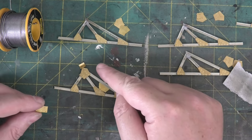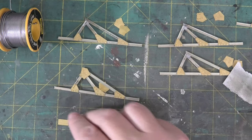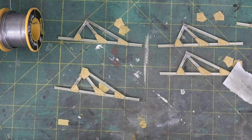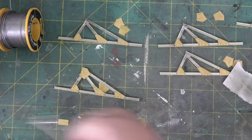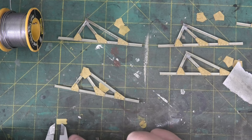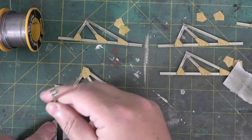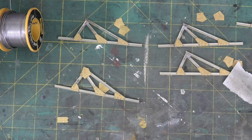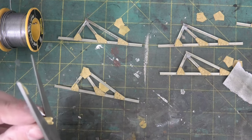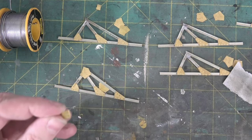Because I'm reducing this to just two rails that go across on the buffers instead of three, I'm having to trim these down a bit. I've got my caliper here which I've used to measure the point there to the top. You just scribe a line on the back of the edge, so that's nice and square. One scribed line - you can actually see that. I've got a nice pair of chunky scissors because it's not thick brass and I just cut along the line like that, nice and straight.